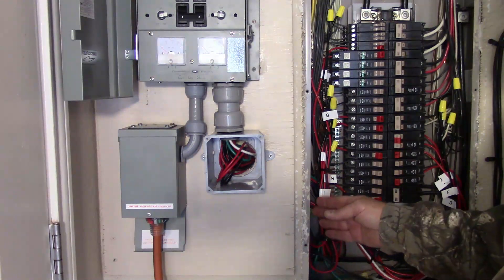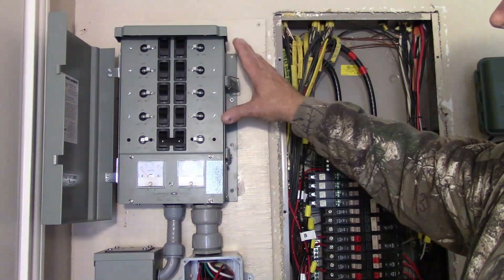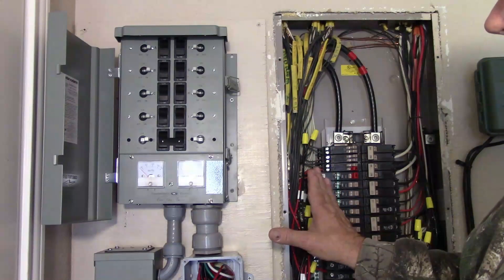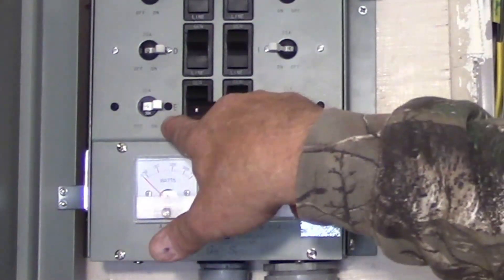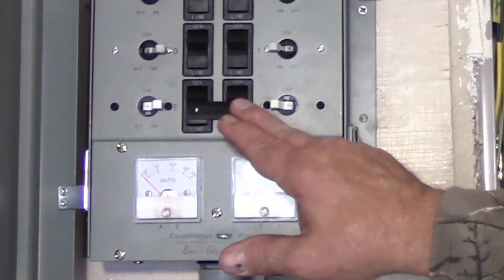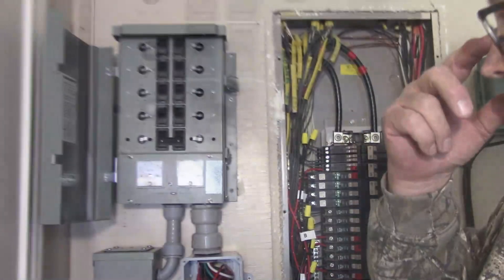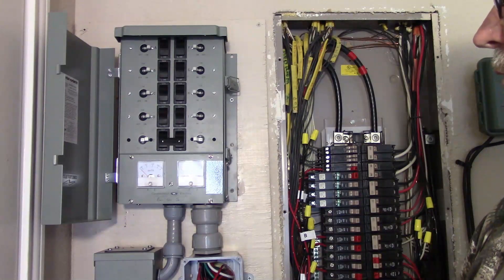This box has got 10 breakers, so you could do ten 110-volt breakers over on your main panel, or what I opted to do was pair these together — there's a little bridge right there for your rocker switch and that'll create a 220 that's going to operate a water heater. A little later we'll fire it up and I'll show you how much power the water heater draws.